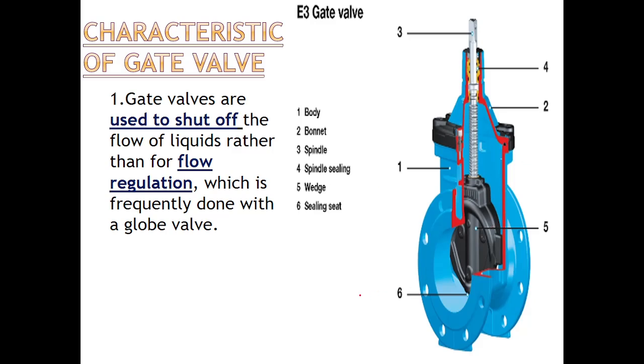Looking at the internal diagram, the flow comes from one side. This is the parallel type gate — the gate is restricting the flow. If we open it, the gate moves upward and allows the water to flow. So the main application of the gate valve is to open and close the flow — it is not used for flow regulation. Gate valve is used where low flow resistance is required. When the gate has moved up, full diameter is exposed to the flow and there is no resistance in the line, so the flow is very smooth. If the valve is opened slowly, there will be a non-linear flow causing too much unstreamlined flow.